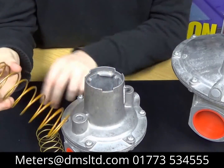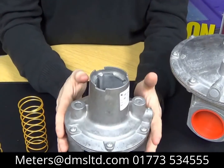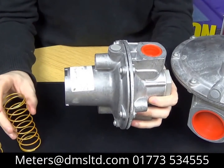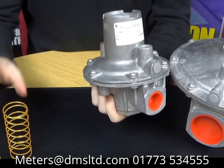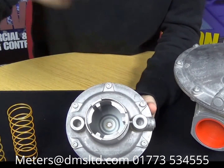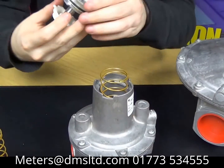This is the spring we took out of the regulator. For practice I'm just using exactly the same model for demonstration purposes. The best way to change these is with the regulator sitting flat, so that gravity is on your side and it's not going to move about at all. But obviously, as per standard service, this can be done vertically installed — you've just got to be careful in making sure the spring is flush with the diaphragm. There's no set routine; it just sits in the actual top around a small ring. We'll just put in another spring like it was brand new, and that lines up on the bottom.